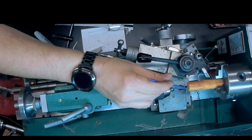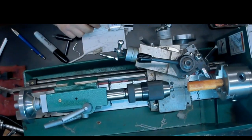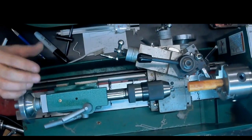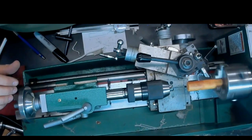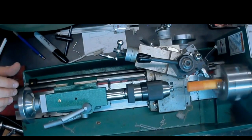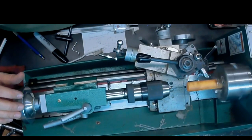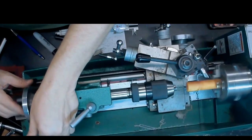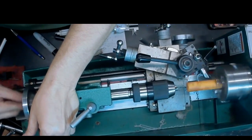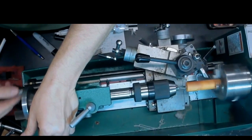Now, as we're drilling acrylic, we're going to use some lubrication on the tools. This is a 50-50 solution of Dawn dish detergent and water. I only use this on acrylic, but it really does help with the drilling. And drilling acrylic is a game of low speed and short distances.